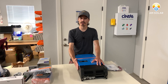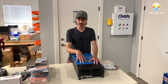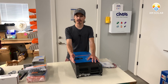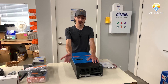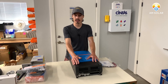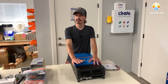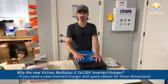That's a really nice feature of Victron's MultiPlus inverters, but this particular inverter has another feature built into it. Some of you may already know that the AM Solar Smart Phase Selector has been out for a while — it's been providing our customers the ability to do the same thing with the MultiPlus 12/3000 VA. Victron then came out with an all-in-one unit, and that's what the MultiPlus 2 is. It's got the capability of doing full AC input and output pass-through capability on a 50 amp coach, which makes it easier for anybody installing this, as you only have one unit to install versus two separate units.